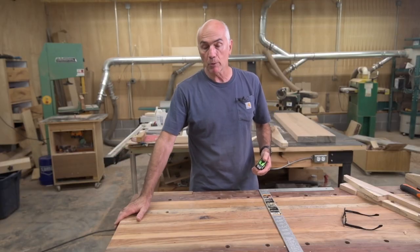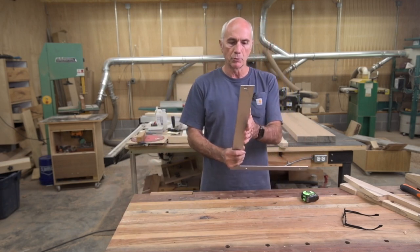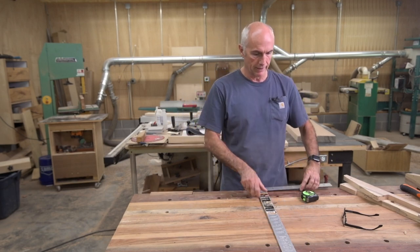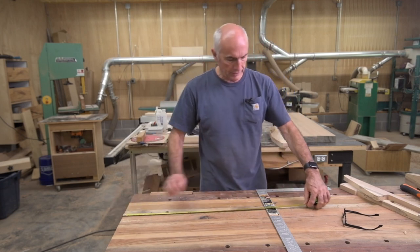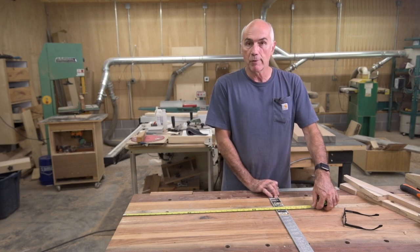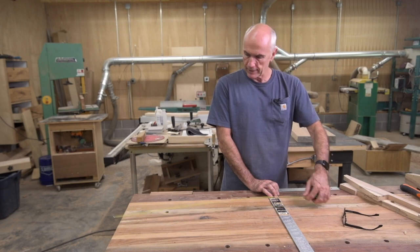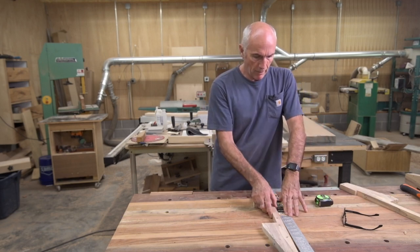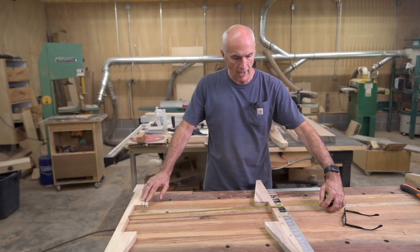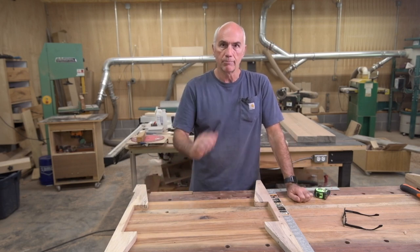If this right edge of my workbench would be the floor and this side of the ruler is the top — the top's going to be two inches thick and the base is likely two inches thick as well. So if I make the height 30 inches, since the tabletop for a dining room table is anywhere between 28 and 32 inches, I'm just going to go for the middle. So 30 inches. That gives me 25 and a half inches for the total length of the upright, and then I've got to make the tenon.